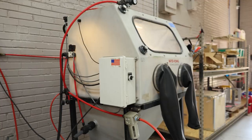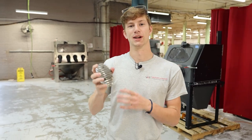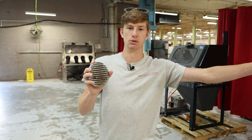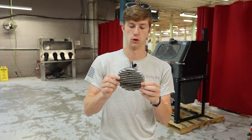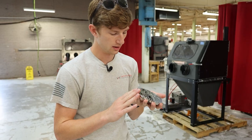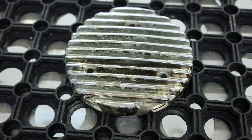And if that doesn't work, we're going to remove it using 120 aluminum oxide. After that, if we want to bring it back up, we might hop back on the glass bead machine. So this is going to be a test part to see what we can do with this chrome piece. The back actually looks much better, but the front is in really bad condition. So we'll see what we can do — let's get to it.